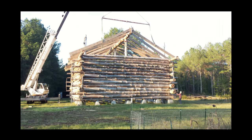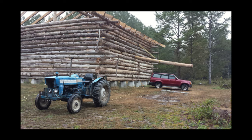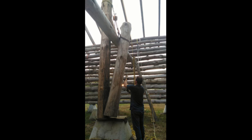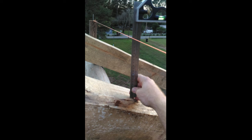All the neighbors came out to watch and everyone cheered when the crane guy honked his horn after the last rafter was set in place. The girder log holds up the second floor. I picked out a log and we installed it sideways through the house with block and tackle. The girder support log (GSL) supports the girder log in the middle of the house. The rafters had to be leveled at the ridge pole and on the cap logs, then spiked with rebar to keep them in place.